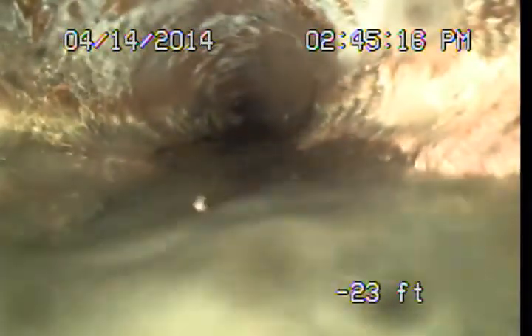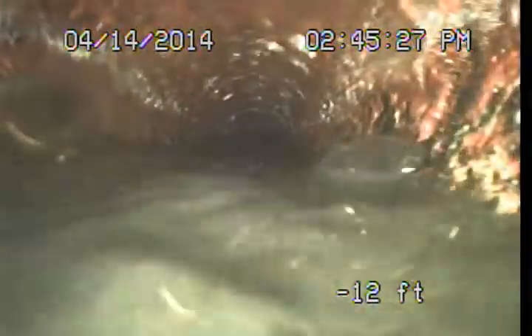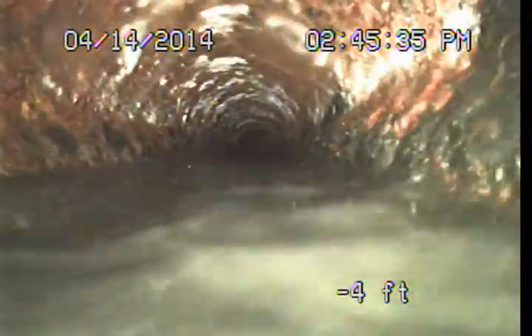What we're pushing through here is the original cast iron building drain pipe. This is the drain line under the building, and this is not the focus of our inspection today. But what I'm seeing here is some pretty heavily deteriorated cast iron piping. I don't know that you're going to be able to see much of this under the structure because a lot of it is below grade. So there is a little bit of an advantage to what we're doing today by dropping down through this location.